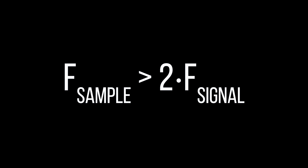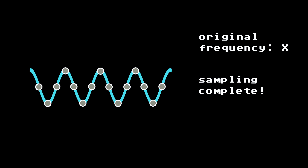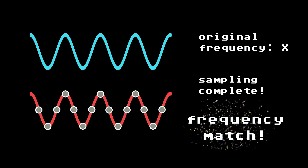Let's consider the sample rate. The frequency at which the audio signal is initially sampled is incredibly important for recreating the echo accurately. In physics terms, what we are doing by sampling the signal is breaking it into Fourier coefficients — snapshots of the amplitude of the signal in time which can be used to reconstruct the whole, so long as the sample frequency is at least twice the highest frequency being sampled. If the highest frequency in our signal is x, and we take sample points more often than 2x, then there is only one way these sample points can be reconstructed: the same frequency as the original.